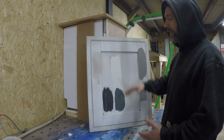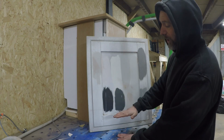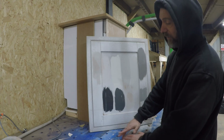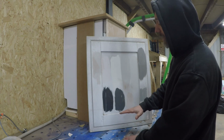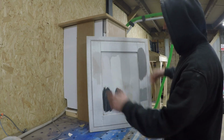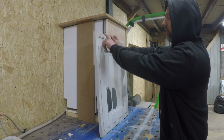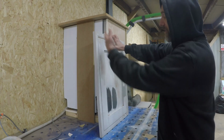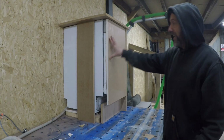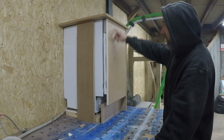I like to make my cabinet doors, because they're inside a face frame, so I don't want the customer to have less space than a standard kitchen, I want to give them more. I'll put a lower plinth on, which is what I was talking about with the Tall Carpenter's video. When I make my kitchens, I do a 4-inch plinth, providing I can, because it is for services, I always survey the job. And then I'll put a taller cabinet door on, and the face frame obviously makes up the difference. So it's normally the same size cabinet door, but the cabinets end up being bigger. But it just means when you've got an integrated door, 9 times out of 10 you'll keep the face frame on it. So it ends up being taller in this case, as I say, 740. Now that doesn't really matter for this, because I'm just doing a standard arrangement. So for your kitchen at home, it will more than likely be anything between 718 to 730 cabinet door.